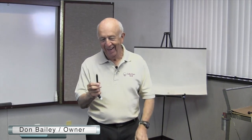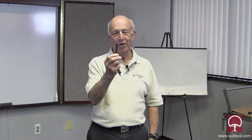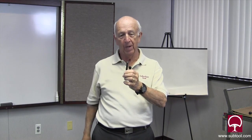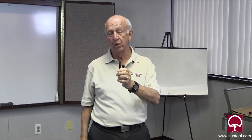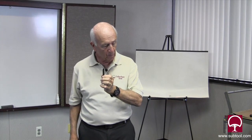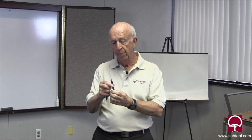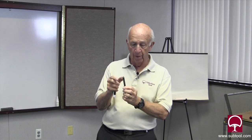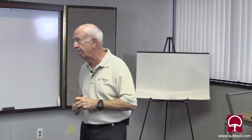Don Bailey. We've got a center here that needs to be ground. This is a 60 degree angle and there are several ways to do it. I'm going to give you a couple of ways in the back, but we're going to show you here up front first as to how we grind it and why it's important. The concentricity between the center and the OD is very important.